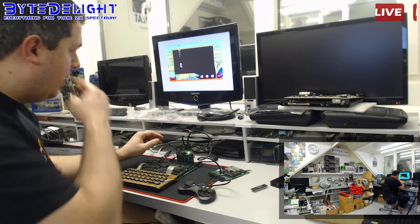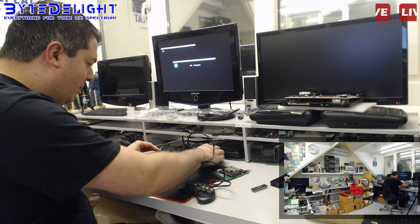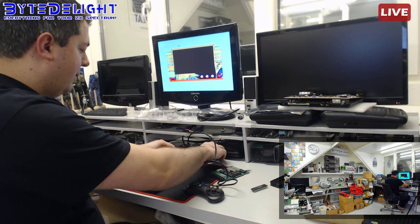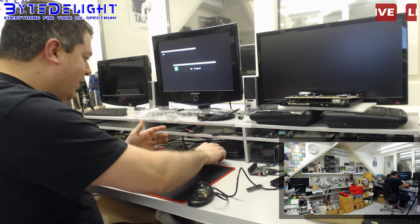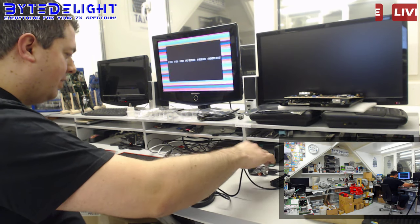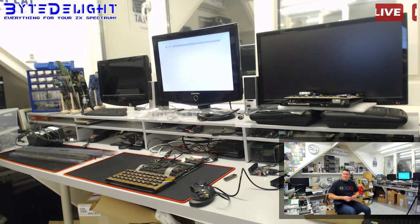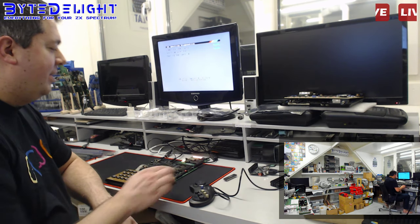Oh! It crashed! Why did it crash? Oh, there's still something wrong? Did I put it in the correct ROM configuration? Let me check. Yeah, I think so. Okay. This board, what is this board doing? So we must run the diagnostic card and see what's going on. It might be the CPU because I'm using an NMOS CPU, but it should work as well. Almost. Dang. Is there an error in memory?